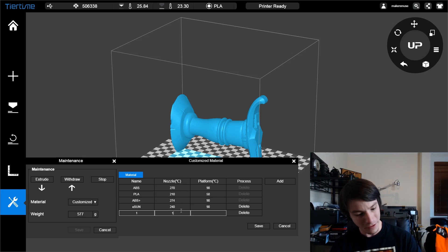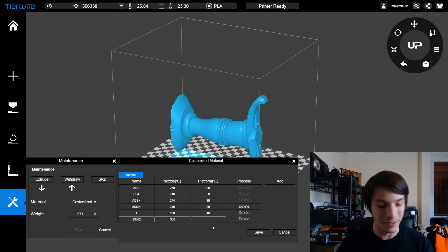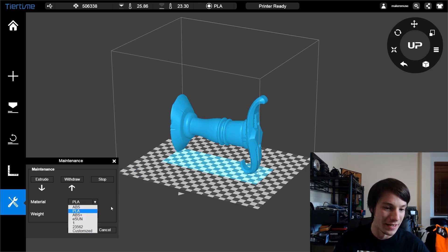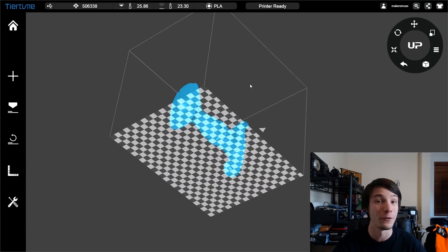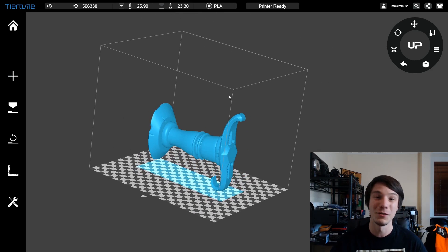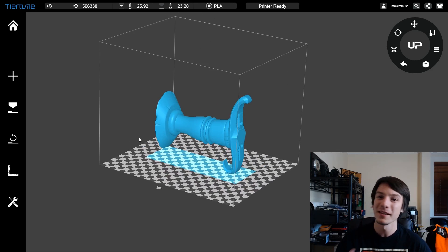Will that damage your printer? Probably — it's pretty hot. But the fact that this little hotend can reach that temperature with no PTFE to degrade is pretty crazy. And of course you can make as many profiles as you like — for example, one that prints at a very low temperature with a 40-degree bed for PLA, and another crazy 300-degree one with a 90-degree bed. Once you've done that, you can save them, and under your material drop-down list when you're logged in they will appear. The UP Studio software still leaves a lot to be desired though — there's no way to preview your g-code before you commit it to the printer, which is a big deal.